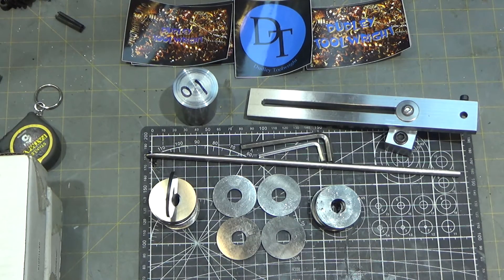That was my mistake — I thought I'd get away without wrapping them but I did not. Number one lesson: when heat treating O1, ramp the oven up according to specifications, which is something like 400°F per hour maximum. To get to 1475°F, that's about three hours on the ramp up, and I did it all in about an hour. Stan's oven really does a great job of heating up quickly, even with that kind of load.